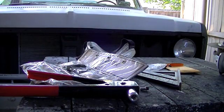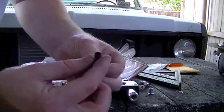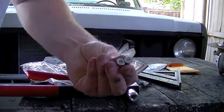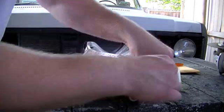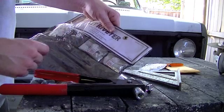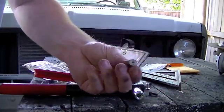I just realized I had a little problem. I got four of these little Allen head socket bolts and they are a number 10-24. Problem is, I just realized I only have these two riv nuts that fit this, and the riv nuts are actually kind of difficult to find. This kit came with several. So I think what I'm going to do is go back to the hardware store and get some number 8-32 Allen head socket bolts, because I got more of those. But for tonight, we're going to go ahead and use the number 10 riv nuts.